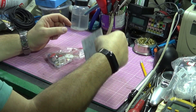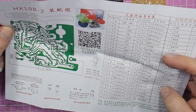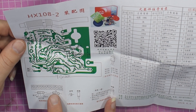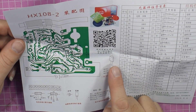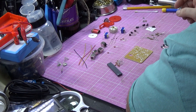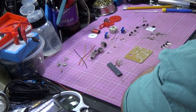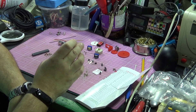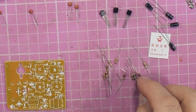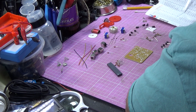Let's have a look at the instruction manual and see what it says. It gives you the components in Chinese, a number chart in Chinese, which is useful, and it tells you which way round the transistors go. It even gives you the numerical values of the capacitors, which is quite nice. The simplest parts are going to be the resistors. If you know your colour code, this is easy. These resistors are a lot easier to read than the five-band blue ones. If you want to check them with a meter, there's nothing stopping you — it's perfectly acceptable.